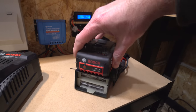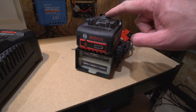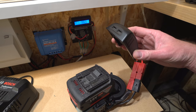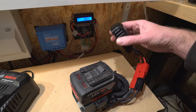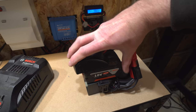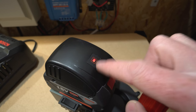This is an 18V drill battery with Samsung 25R cells — pretty high-power cells that can kick out about 20 amps. So this isn't going to run for long, but it will provide a decent bit of heat. It's still a working drill pack — I use it on that angle grinder over there. I grabbed one of these USB charger adapters from Amazon that plugs into your drill pack, took it apart, and soldered some big fat wires onto the terminals. So it still works as a USB charger, but when you slide it on here you get a load of hot air coming out.